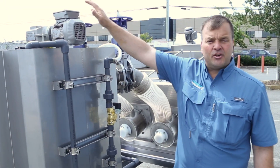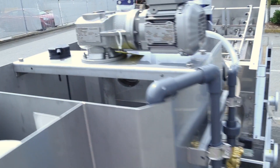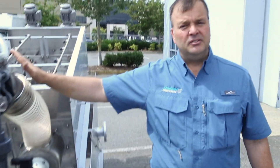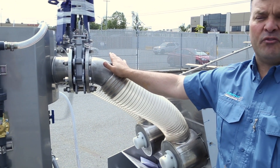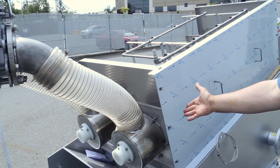Your materials are mixed together by a one-half horsepower motor with an agitator attached. From there, your materials go through gravity flow to individual gate valves, which can allow you to isolate a single cylinder if maintenance is required, into the press itself.